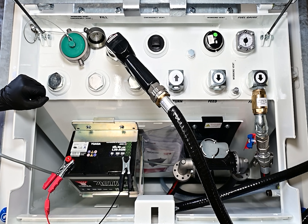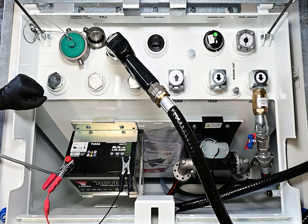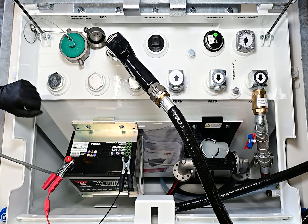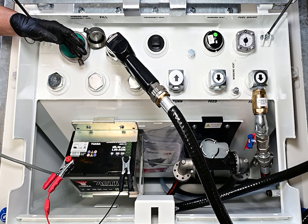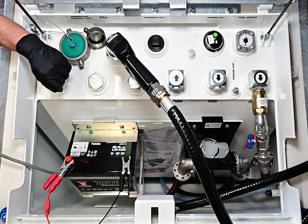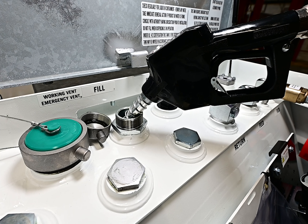Keep it running for 30 seconds. If it hasn't primed yet, turn off the pump, allow it to cool for two minutes and try again. Sometimes the process takes a little bit for the air to fill up through the non-return valve and go through. You will hear the nozzle cough — that's absolutely normal. Just let it go until it runs smoothly, then you can go ahead and turn off the pump and switch off the nozzle.